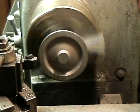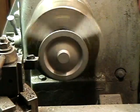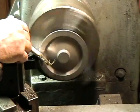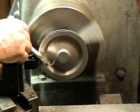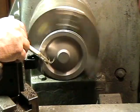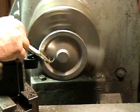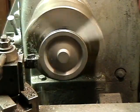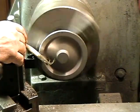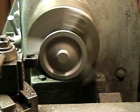Okay, I'm going to start with the machining. This is the first side. I'm going to take a cut on the OD first. Go to my zero, which I've already got marked. Zero on the readout. Just feed it in by hand — push it in manually, carriage wheel by hand. Now, you want to keep the brush on here because if you don't, there's stuff flying all over the place. That should be to my size; I'll tell you more about that in a minute.